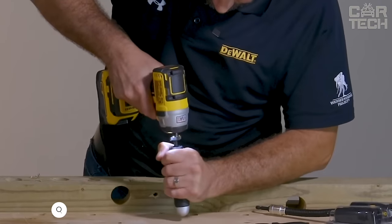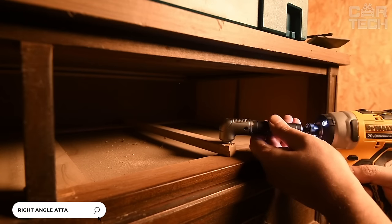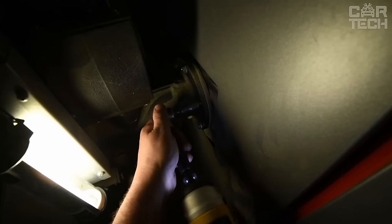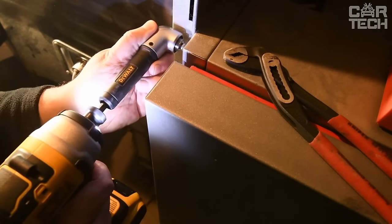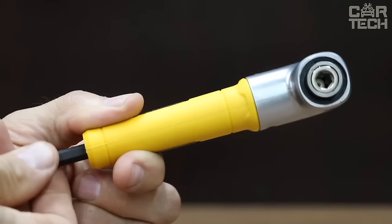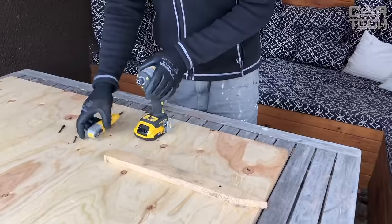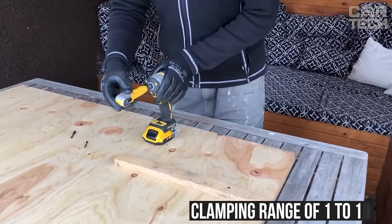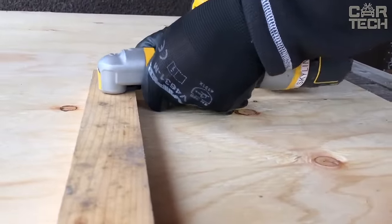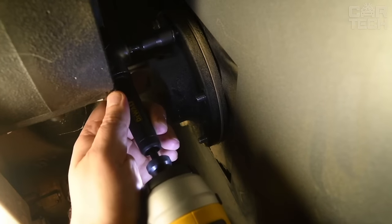This gizmo makes it much easier to work with a drill or screwdriver in hard to reach places. Now, to screw into furniture, you don't need to find a shorter screwdriver and twist your arm into an incomprehensible shape to get to the fastener. The angle adapter will get there for you — it is an extension of the drill but at an angle of 90 degrees. The chuck has a clamping range of 1 to 10 millimeters, so you can fit the drill bit or bit you need. The adapter comes with a side handle and a wrench to tighten the chuck.